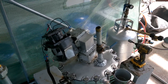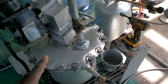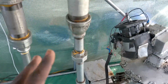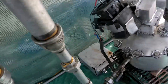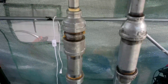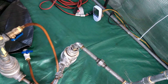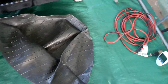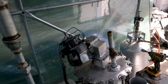For everybody new to the system, let me break it down. Microwaves are formed here from this magnetron and shoot down into the chamber, heating up what's inside, which forms a gas. That gas or vapor comes up and hits this condenser full of steel wool, causing any condensate to fall down and be collected in this jar. After that, it hits another steel wool condenser, goes into this water bubbler, then through a dryer filter with kitty litter, and into this yoga ball to be collected as clean gas.